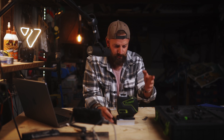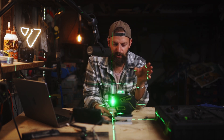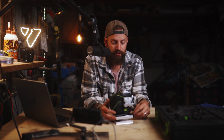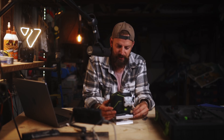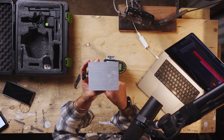Your other accessory is this platform — it basically screws up and down. If you are trying to get micro adjustments on exactly where you want your line, you turn the laser on and just twist this, and it gives you millimeter precision. If you were trying to get a line to lay a row of tiles all around the bottom of your bathroom, this gives you that millimeter precision. The fact that you also have that laser on the bottom means you're going to get really close to the ground, which is really cool.